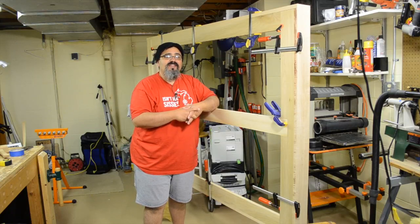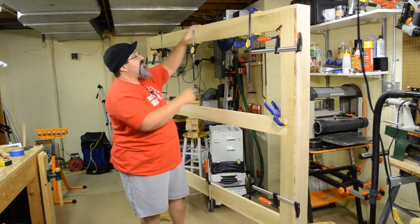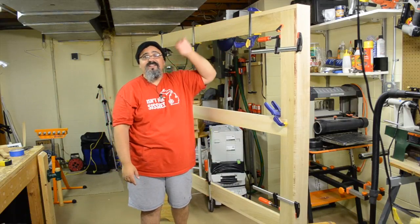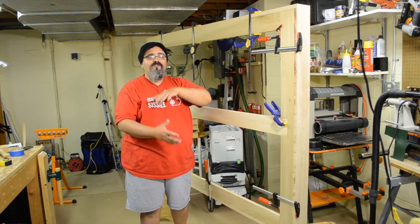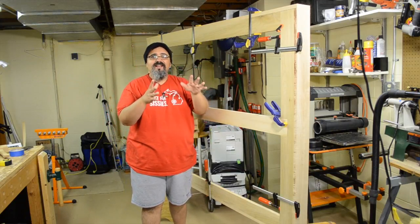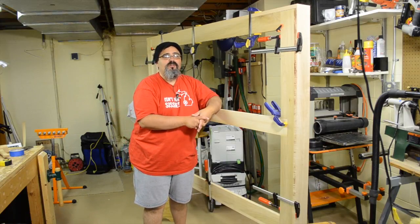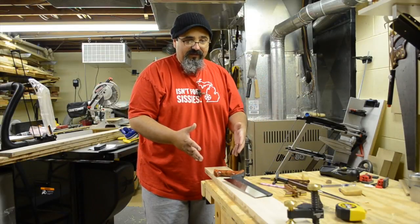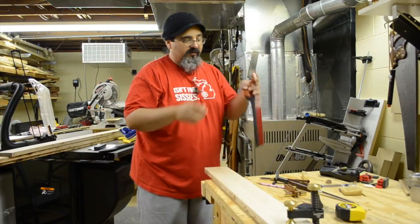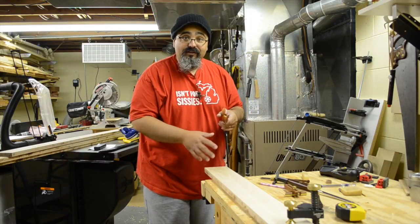Let's go ahead and take a look at that footage. With the size of these boards — this side comes in at like 73 and a half inches, and the front here about 53 inches or so — it's not something I can simply put in my vise and stand up. So to cut these dovetails, I have the board laying flat against the bench and I'm going to come in with my saw inverted and actually attempt to make the dovetails themselves.